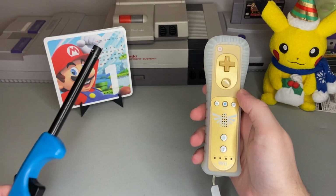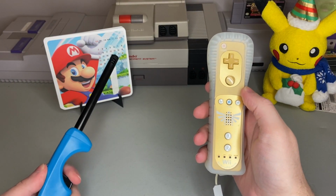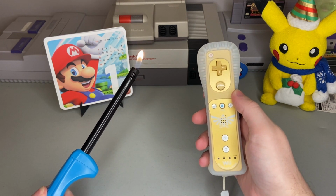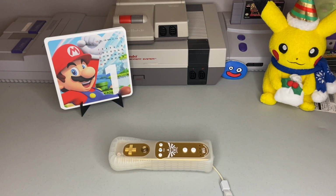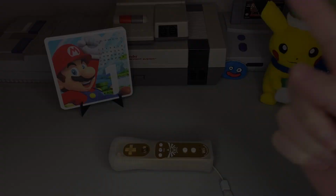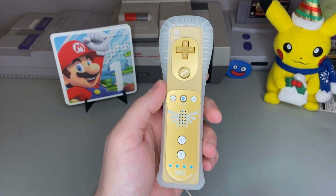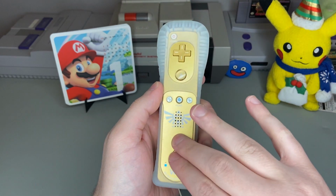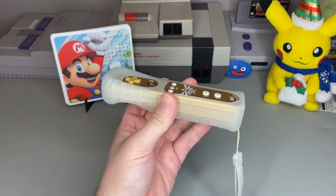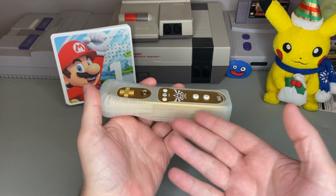We then have the issue of temperature drift, which basically means that due to changes in temperature and humidity, the gyro sensor would think it's moving even though it's really not. This was solved with software that simply tells the gyro sensor, "No, you're not moving." Next, the issue of the Wii MotionPlus getting out of sync due to the wireless nature of the device was brought up. This was solved by using the accelerometer in some way that isn't elaborated on,